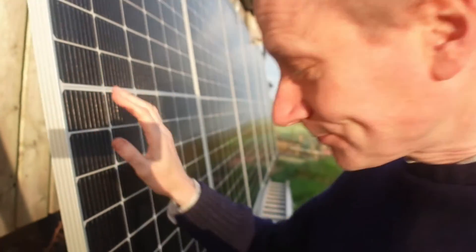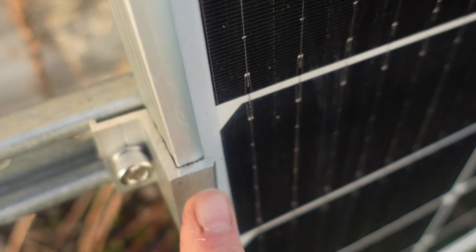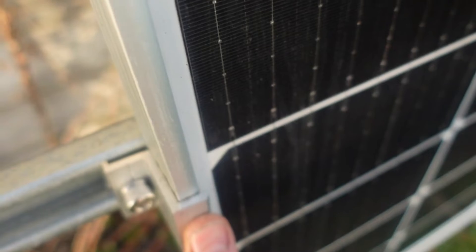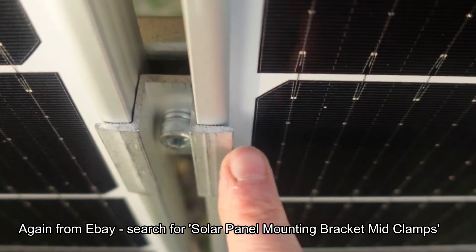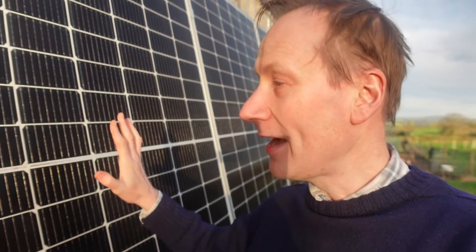To fix the panels themselves I've used these S-brackets — I'll put in the description exactly where I got them from. They're held on with Allen bolts, and the clip — it's really more of a Z or S shape — just bolts the solar panel down on the end. When you've got two solar panels next to each other, I'm using a slightly different fitting which clamps both panels onto the frame. These six solar panels give me roughly 2.5 kilowatts of extra power in addition to the ones on the roof, and they purely charge the batteries.